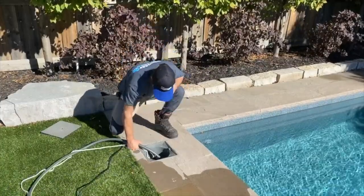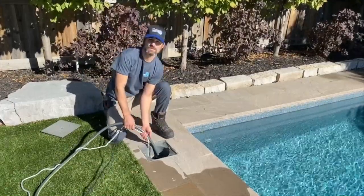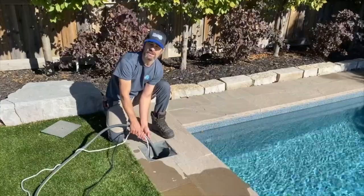The best indicator to know when the sump well is done draining is actually an audible thing — it can sound similar to a soda straw. If you hear that, come over and have a look. If you don't see any more water coming into the sump well, then you should be okay to shut it off.